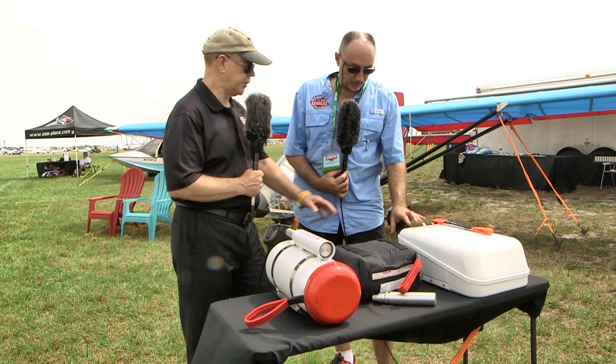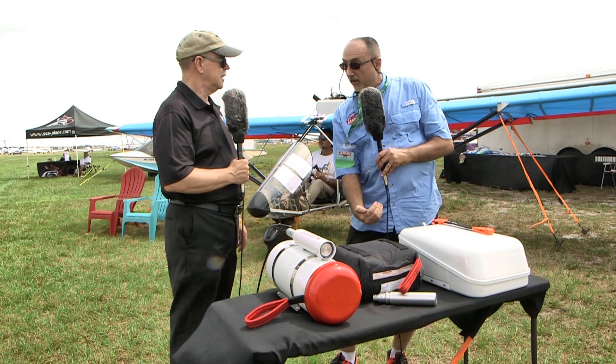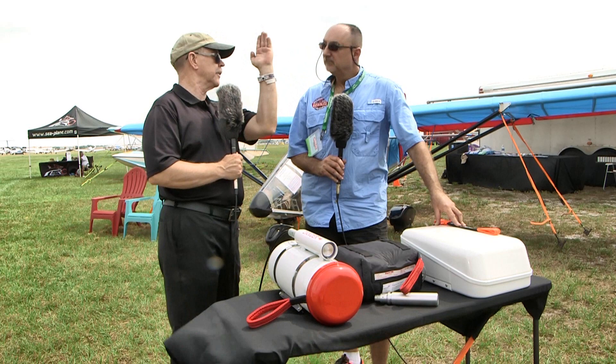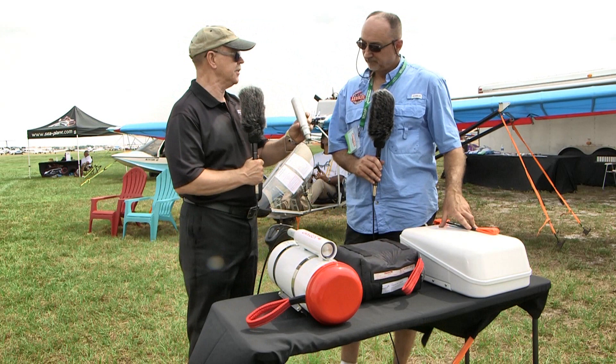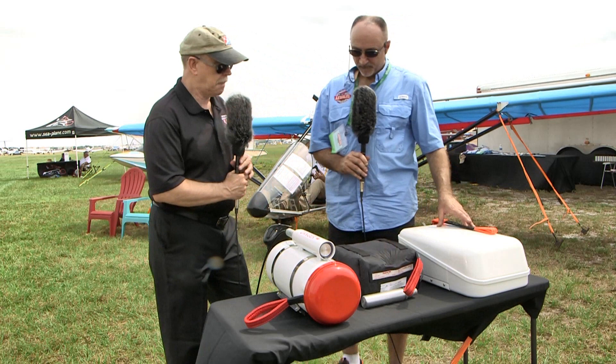On the VLS, the rocket motor is mounted to the aircraft slightly away from the pack itself — not physically attached to the container. For example, on the Challenger they use a bracket around the root tube to hold the rocket right behind the VLS pack. The rocket motors are very stable once they have a load trailing behind them — like a string kite. Despite having no fins or nose cone, the load trailing behind it keeps it going straight away.